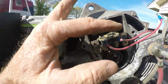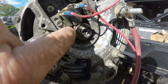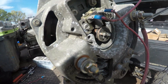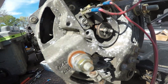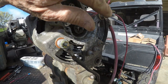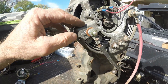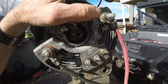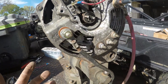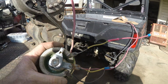What you'll use are these two wires that take care of the brushes — so it kind of acts like an actual big welder. It has armature and a set of brushes. Now these two wires — it does not matter how they are hooked up. It doesn't matter on the case of the alternator; it's got a negative out and a positive out. I always hook them up that way but they can also be switched and it'll still weld. It doesn't matter.